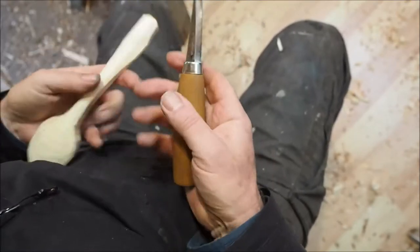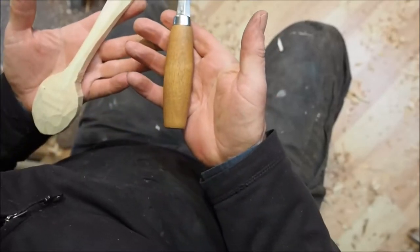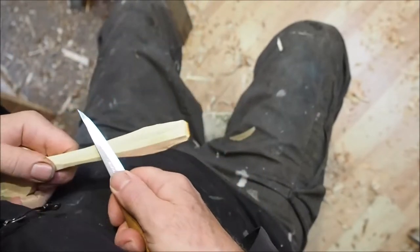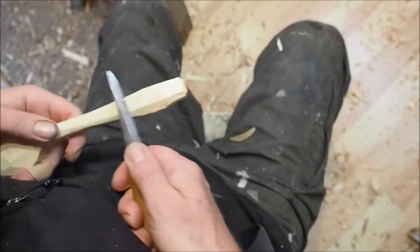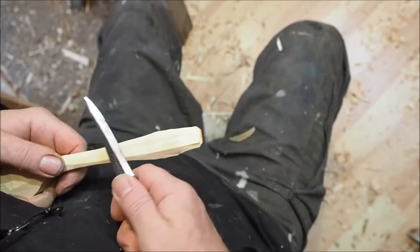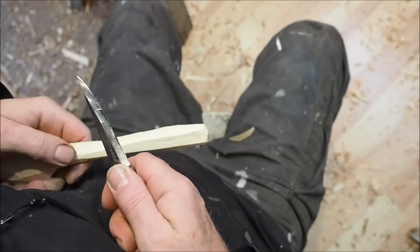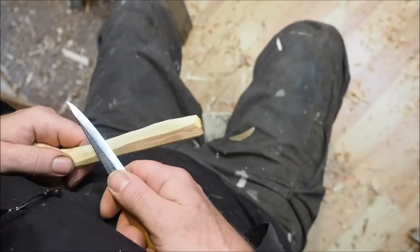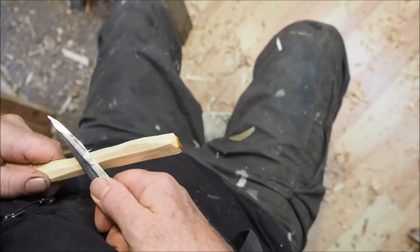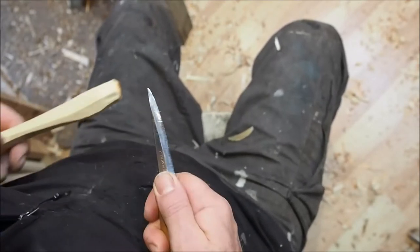So chest lever, it's all in getting the knife position right in your hand, the thumb on the top to help push down into the wood, and then just getting the feel for that tiny amount of twist you need to put in to get the knife and the workpiece. You can change the angle of the workpiece, equally you can change the angle of the knife. But after you've done a bit, you'll start to feel, once you've established the surface, you can run along a surface.